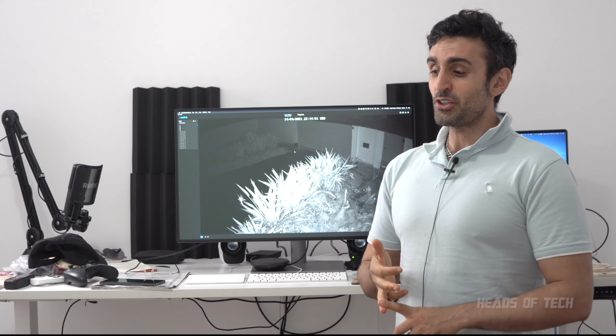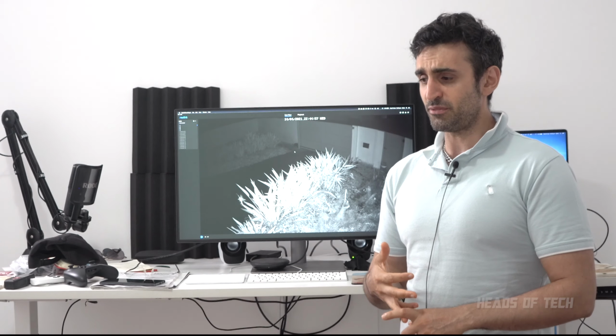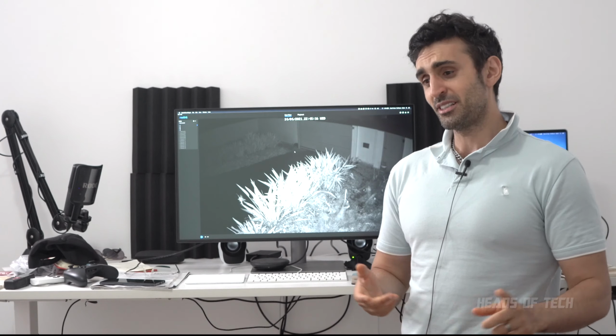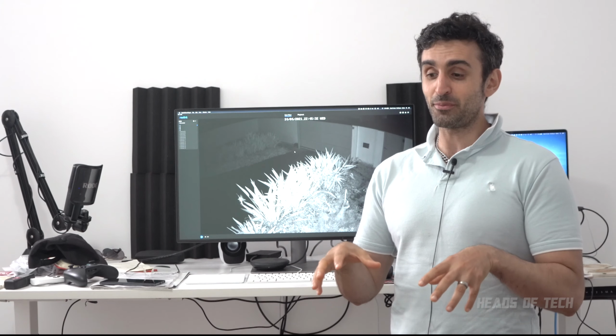And the good thing about it is you can block it from accessing the internet. The way I've done it is advanced. I use a firewall called pfSense, and I single out the IP address I've given it. I give it a specific IP address, and I tell pfSense to block any internet calls to and from that IP address. That means I can still access it using my Wi-Fi, but if I'm in Jamaica or Nigeria or America or Russia or China or England, basically anywhere outside of my Wi-Fi, it won't allow it because it won't access over the internet. I also have a local firewall on my Mac, and that firewall blocks the app from accessing the internet itself. So you can access everything through the local area network, but not on the internet.